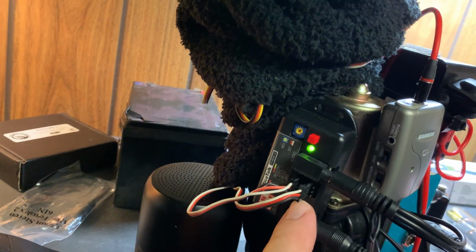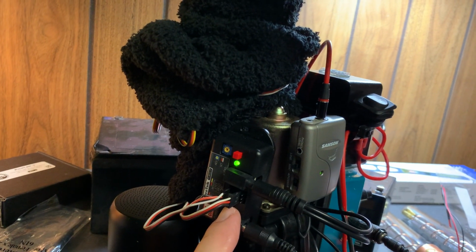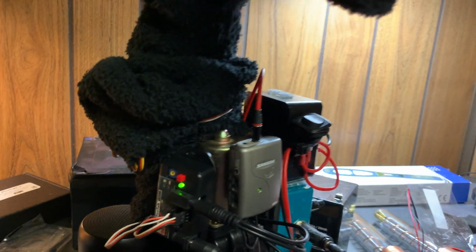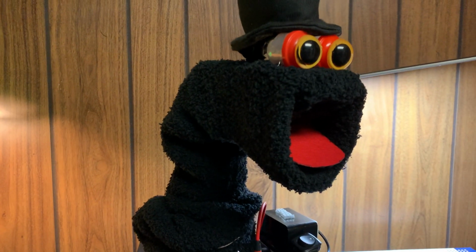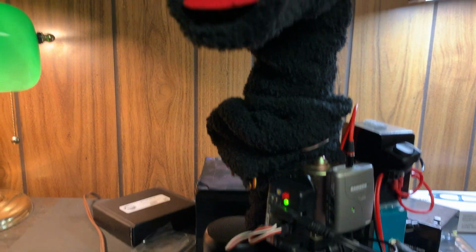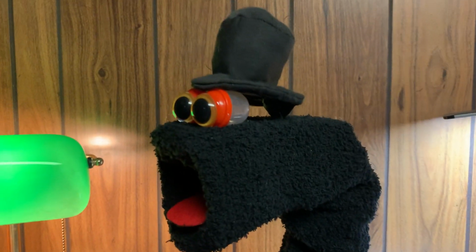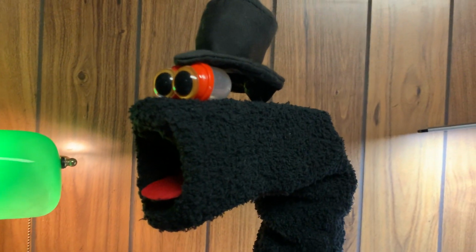torque, because anything past 6 volts will fry your servos. I learned the hard way, so that's it. 4 or 5 or 6 volt power pack, okay, and you will be able to power this thing for 3 or 4 hours, and that should be enough time. You can always plug a new one in if you have to, so buy 2, and they're not that expensive.